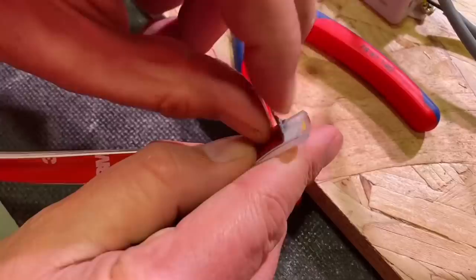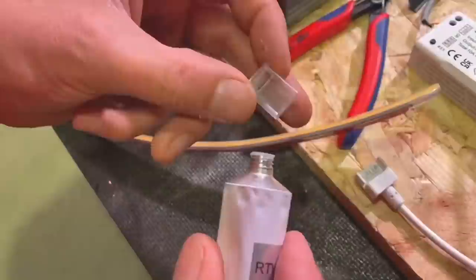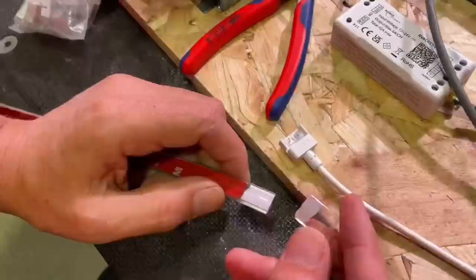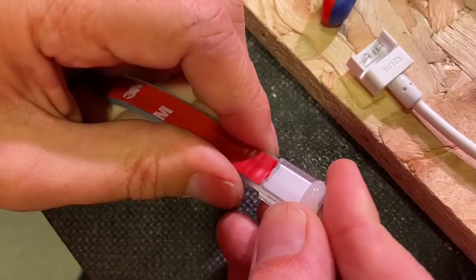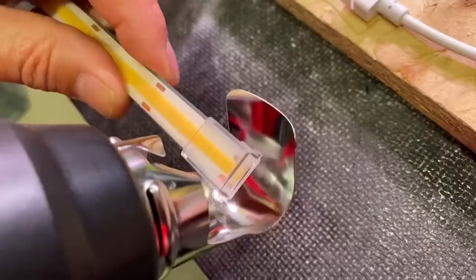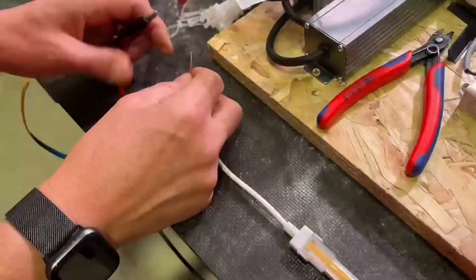So this is the Macau IP67 LED strip. Is it more complicated to connect to? No — I'm still going to use the easy clip connector, there are just a few more steps. First we need to remove the 3M adhesive tape from the back of the strip in the area where we're going to make the connection. Then we bring in this plastic end cap — put some RTV silicone in there, just a small amount. Then where we've cleared the tape, we push the end cap on. There's a window on the bottom of this end cap that goes on the adhesive side. You'll see the excess silicone has squeezed out. Now we get the strip warmed up a little bit — nice and supple — then we use the IDC connector, push it through the silicone and the PCB. That clicks through. You can see where the connections have gone through the PCB. Let's do a quick test — being clear, it allows the light to come through as well.